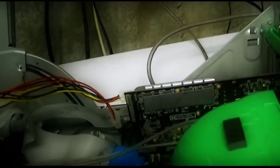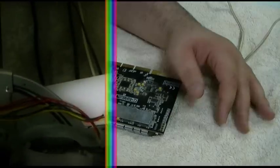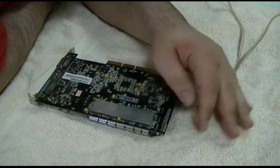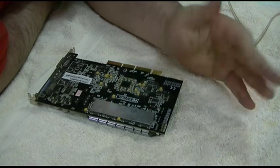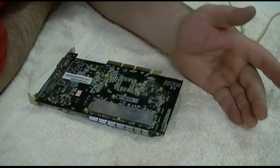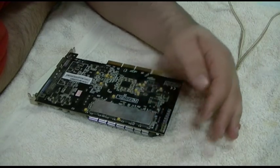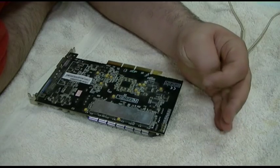Clearly the connector is connected, and it must have been working at one point because otherwise that fan wouldn't be noisy. That may have been due to the power supply in that machine not being powerful enough, or it could be because of this connector. So we're going to re-solder it and try it on that eMachines T4160 before I button that up.